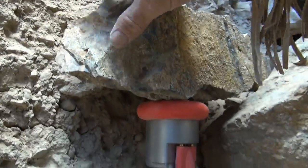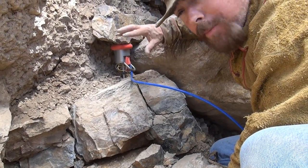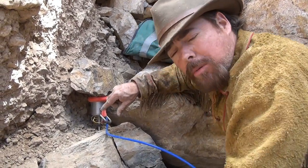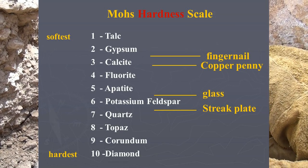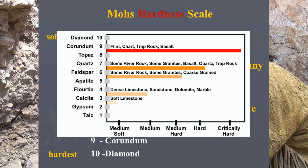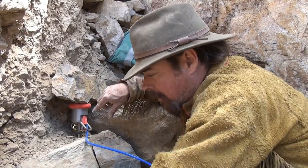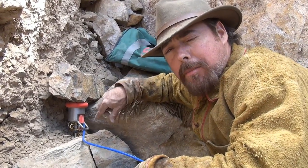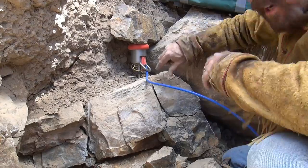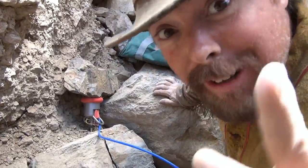You've got to keep the head inside as much as you can because the whole thing works off compression. Stack rocks on top of the heads whenever you can. On this angled one, I'll show you how to stack rock to keep the head in, and we'll get into using multiple boosters. Limestone is a really soft rock — if you look up Mohs hardness scale, M-O-H-S, this is a 3.5 to 4, relatively soft and sedimentary with a lot of bedding planes, so it fractures really easy. The harder stuff will take a little more work.